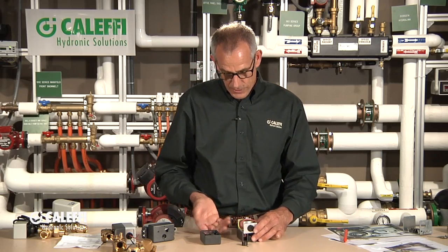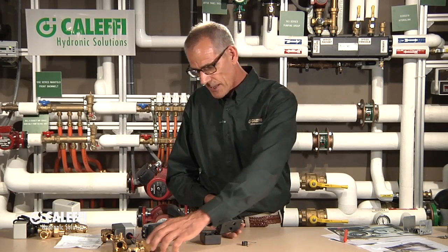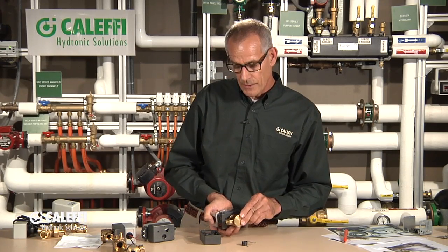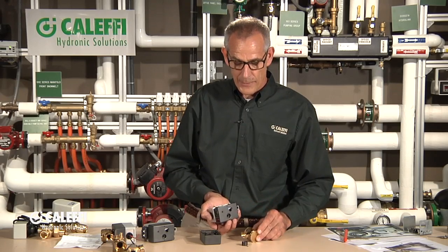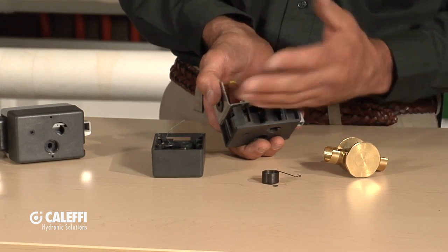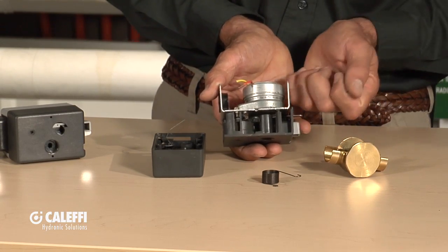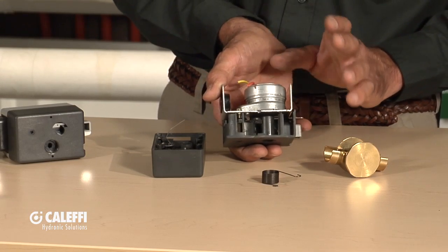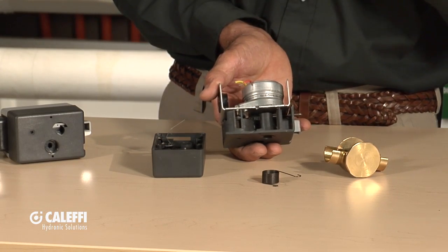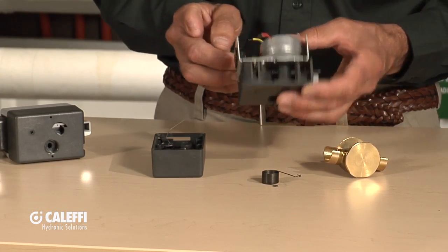The polycarbonate on the bottom and aluminum on top work together. When this is on the body with high-temperature fluid going through it, that heat conducts up through the stem. Even though the polycarbonate provides a thermal break, some heat still goes up through the stem and ends up at the motor and motor mounting plate. By making this out of aluminum, we do two things: the corrosion issue goes away — most other brands use steel that they plate and then it rusts on the ends — and the aluminum also acts as a heat dissipator. Like the back of a Mac screen that gets warm to emit heat, this aluminum acts as a heat emitter as well as a product that won't rust or corrode.